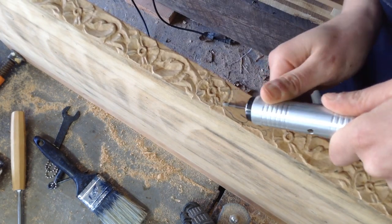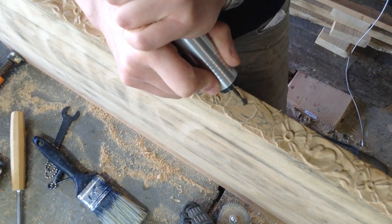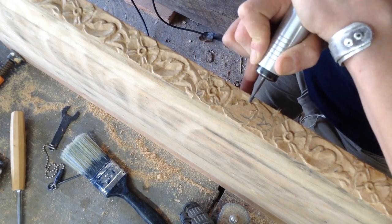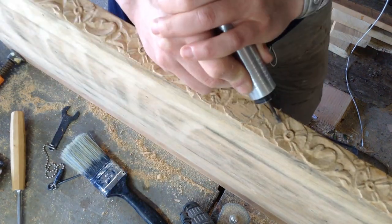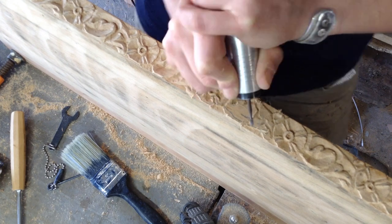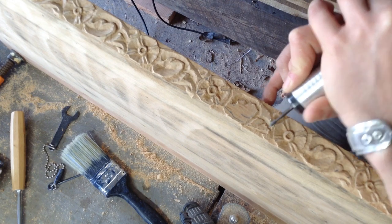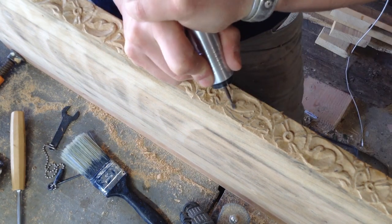With the flower, I want the shape to kind of sink into the wood, so I removed a ton of material around the center. The pattern between the flowers is a decorative swirl, almost a leaf sort of design. I'm going through and undercutting along the entire side of my pencil marks from the carbon paper. By creating undercuts it creates depth — when you cut underneath an object it creates layers so the relief looks deeper than it actually is. I'm going through creating that initial round of undercuts and shaping up the piece.